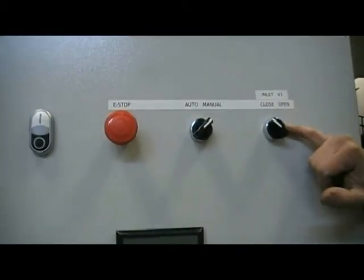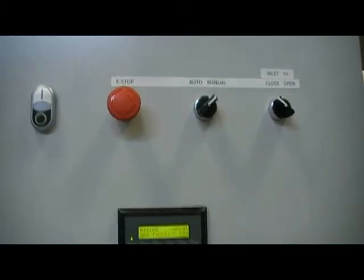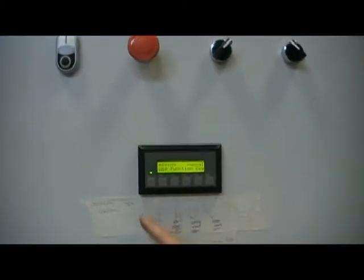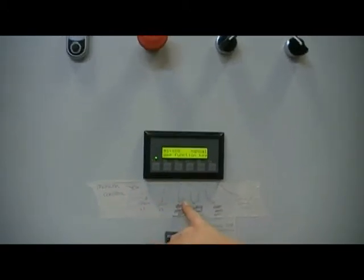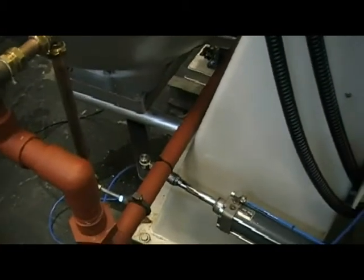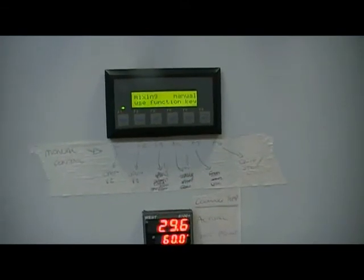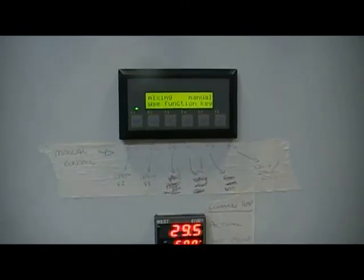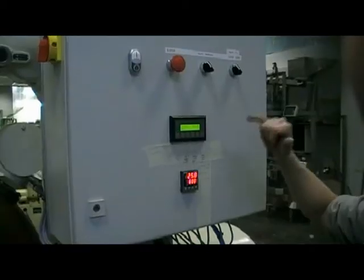You can also put product into the machine by opening valve V1 in manual mode. It is, as it says, manual. These combinations of keys can be used together — you can run fast and open valve V2, for example. Pressing the F6 key will cancel all those instructions. In manual mode, you do have to understand that perhaps if you open valve V2, the product is going to be released, and so on and so forth.